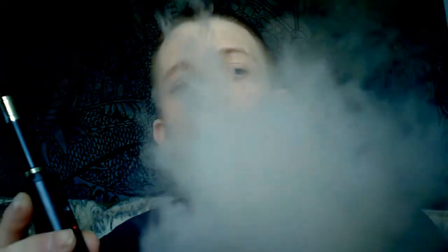But other than that, like a 4 ohm, I mean, I got a 3 ohm Cisco atomizer in here, and I can put it all the way up to 6 volts, and it'll vape at 6 volts. See, I don't know if you can see it. 6 volts. That's very nice power running to it. When you put it on 6 volts, you're getting 6 volts. You're not getting underload. What it says on here is the voltage that you're vaping at.